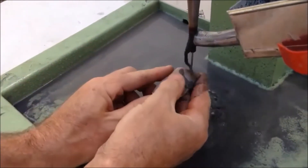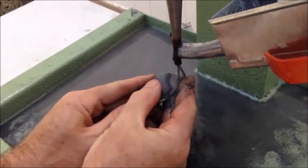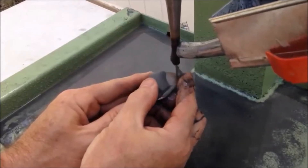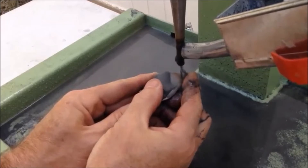So the pump is picking up the grit, so I grabbed a nice hard piece of agate and I'm going to drill that. Now when you're drilling you don't apply too much pressure. If you do you'll start hearing a screeching sound.